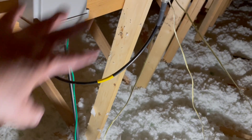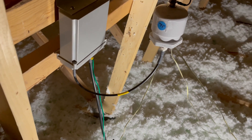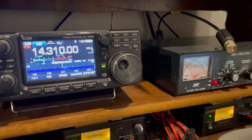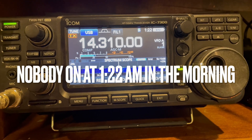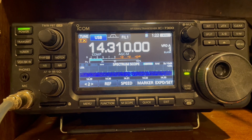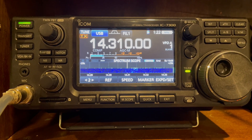I should be able to go downstairs, turn on my IC-7300, and all this should work. The disc cone is hooked up, so I'll try that and see if it helped compared to where it had been — first in the basement, then on the deck, and now at the highest point of the house. So far everything looks good. I've got the bigger RG-8U cable on my IC-7300 and I've got a lower noise floor, no intermittent streaks I'd sometimes get at night. SWR was 1.2, so it's already doing better.